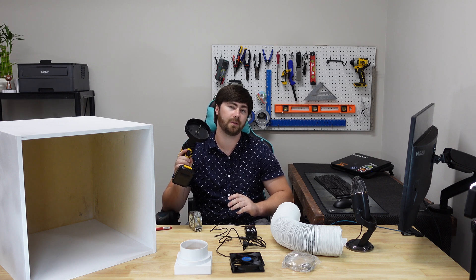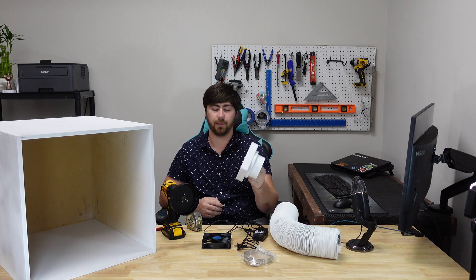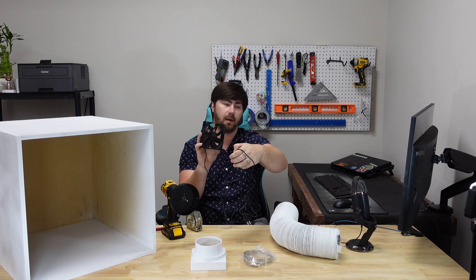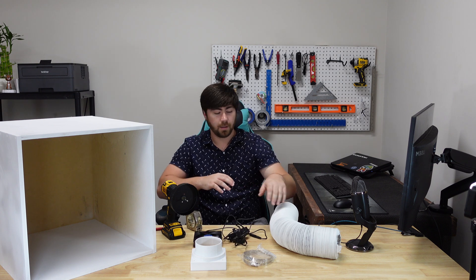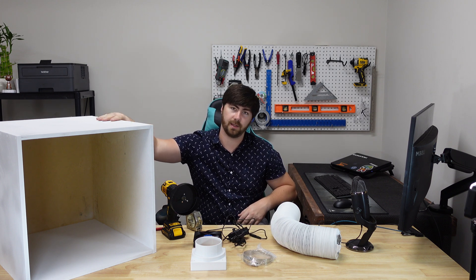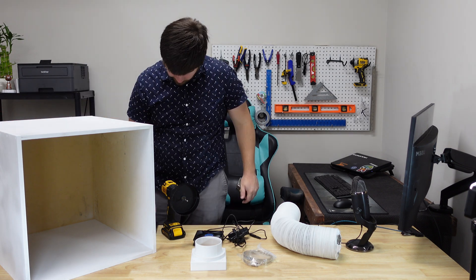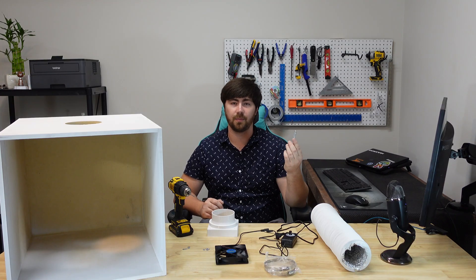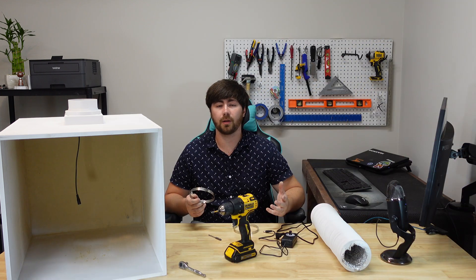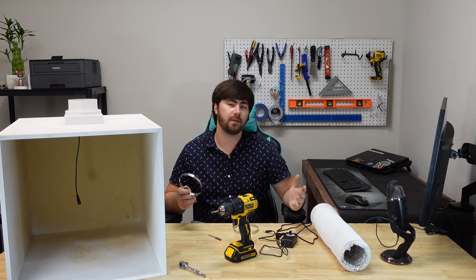I recommend using a four or five inch hole saw and drilling a hole at the top center of the enclosure, though you can also drill a hole in either side or the back. You'll need a 3D-printed exhaust port — I'll leave the link in the description — as well as a fan, which you can buy as an inline fan off Amazon or from your local hardware store. You'll also need a hose and a couple of hose clamps to connect your exhaust port to the window. For cutting the exhaust port hole, I used a tape measure and marker to mark the center, then cut it with a four-inch hole saw. I attached the exhaust using number six machine screws through both the exhaust port and the fan, tightened with nuts on the other side. The hose clamps will be used to attach the hose to both the enclosure and the window exhaust port — we'll save that for later.